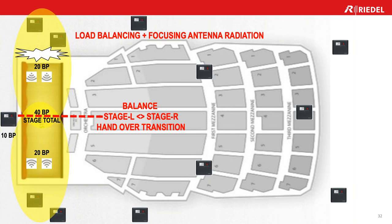And at some point, they're both going to discuss the topic and say, you know what, I can't really host this belt pack any longer because the distortion levels are too high, and you look like you have better levels because you're pinging that belt pack as well. So let's switch it over to you. And that's done in the belt pack? That's happening in the antenna system, in the software mechanism that's managing the antenna system. But the antennas themselves are pinging the belt packs and taking these distortion readings constantly.